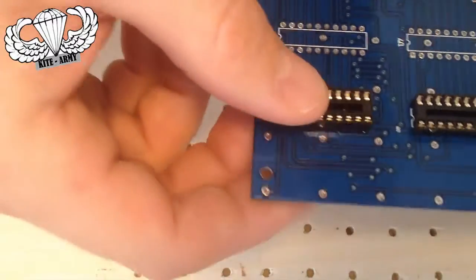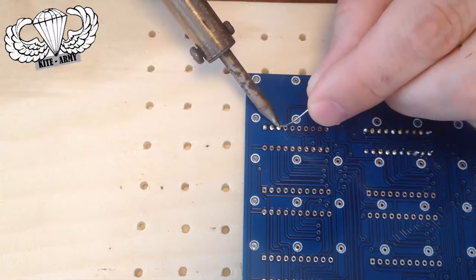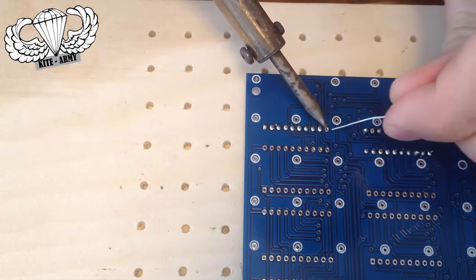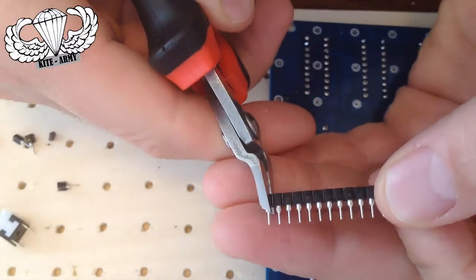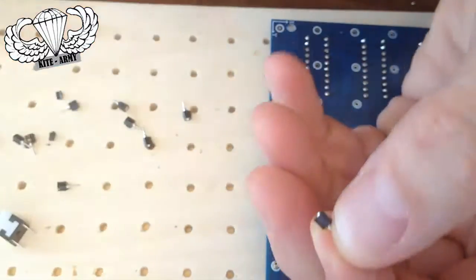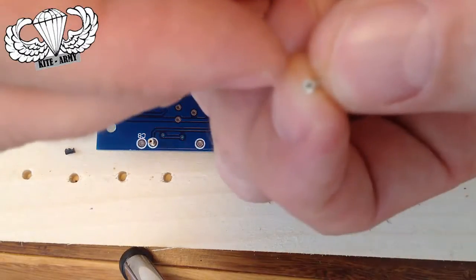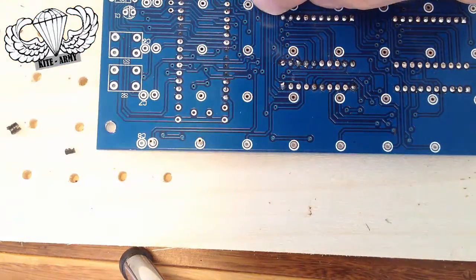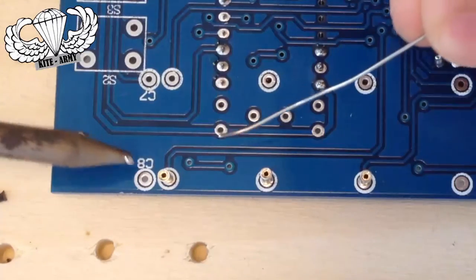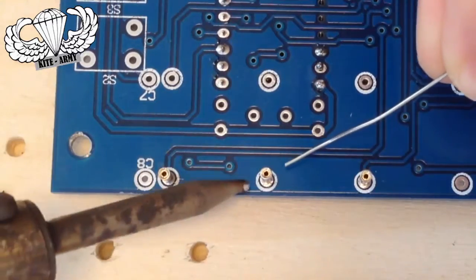Here I'm putting an integrated circuit connector onto my board, flipping it over and adding a little solder. When I first started these were a lot sloppier, so that says something for the benefit of this project. The kit came with these connectors — I didn't know what to do with them at first, but I realized that if I soldered them into the grid that matches the legs of the cube, it would make connecting the cube to the board really simple. You've got to cut off the insulation they come with, slip them in the hole, add a little heat and solder, and they're permanently attached. They don't have to be exactly straight because the layer of solder below kind of floats them so they square up on their own.